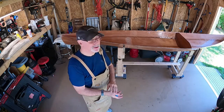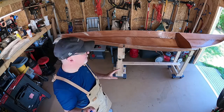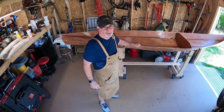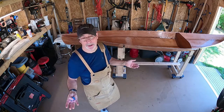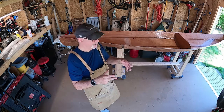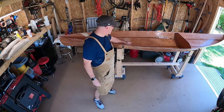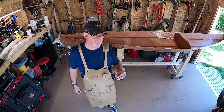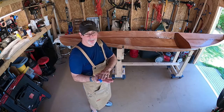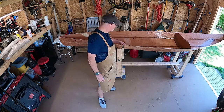Although my Instagram pictures look really good and probably some of these look really good, if you really look at it, it's not. And a couple things that I've found so that when I build this next boat, I actually put some reverse sides, and so I may have the same problem on the other boat. When you're putting these two sections together, one side, which is the outside, will stay clear. On the inside, you're putting a little bit of filler in that clouds it a little bit, and plus you're also putting the 3-inch tape on there that you're burying, so it's not as clear. And you probably would have had that on the other side.